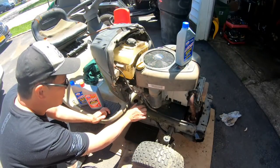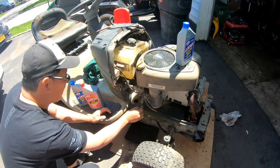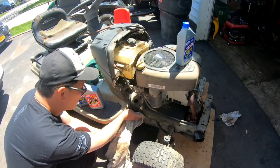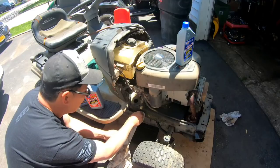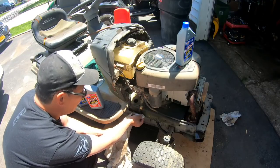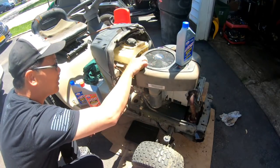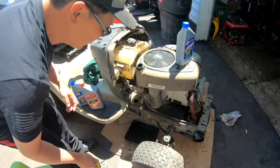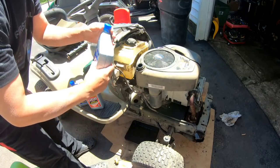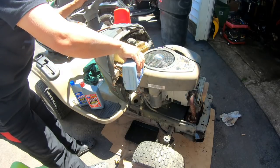Okay, just about stopped. Push it back in, turn it, put the cap back on. That's all it takes to change the oil on this thing. Pretty easy, actually. These things aren't very reliable, though. Sometimes they break while you're riding, vibrates, whatever. Cap comes off, all the oil spills out, and you blow your engine. So we're just gonna put in some SAE 30 plus motor oil from Lucas Oil. This is like a couple of ounces. Put another jug in after this.